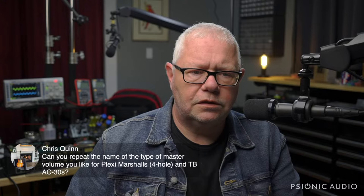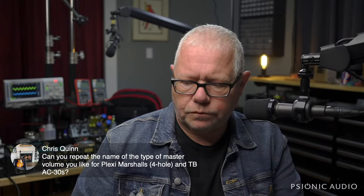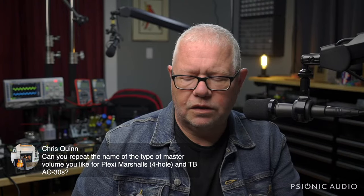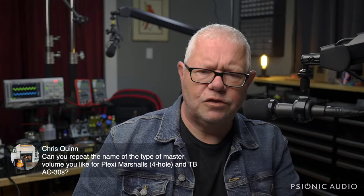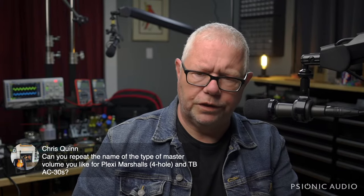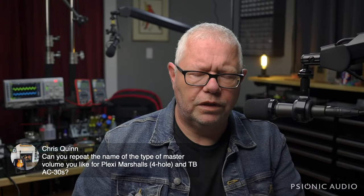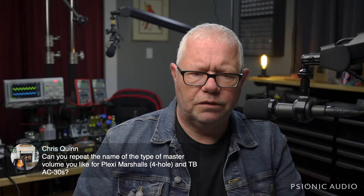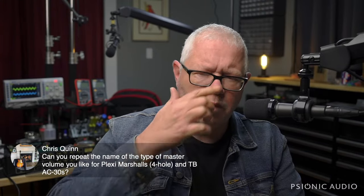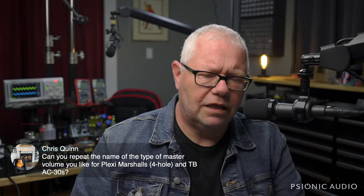Hey, Chris Quinn. Yeah, it's called a post-phase inverter master volume in general, and the type I like is called the Larmar, L-A-R-M-A-R, because the guys who first posted it on one of the Marshall forums were a guy named Larry, who's a really good tech in Germany, and Marstrand. I don't know if they both posted it independently or came up with it together. It's a very sensible thing, and in some of my videos, I've shown how it works. I've drawn it out for people. It's a simple thing.